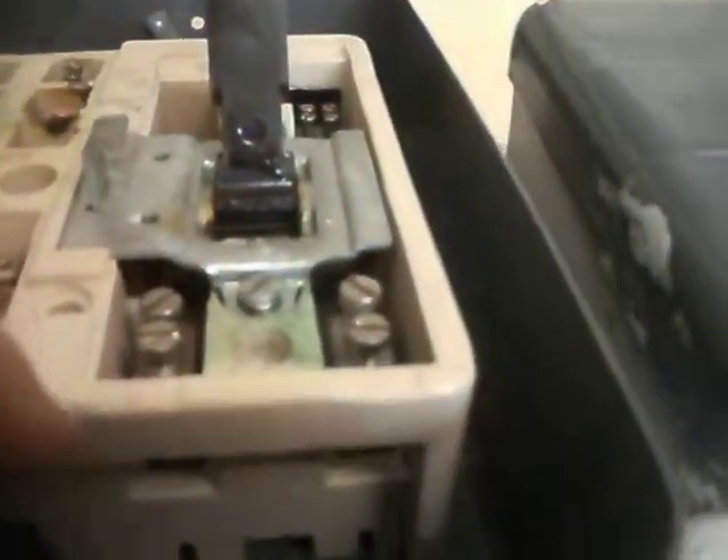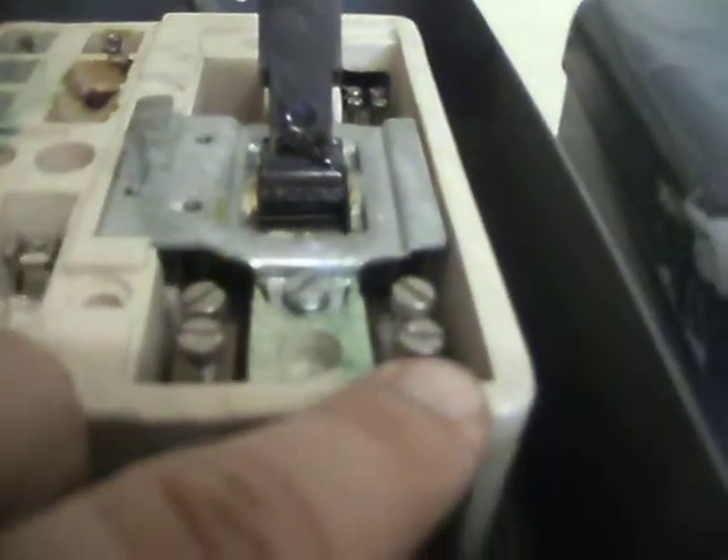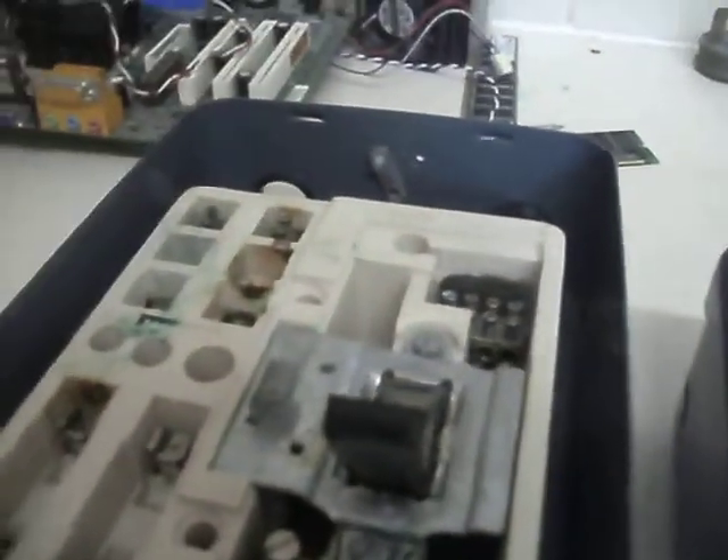We've got a big hole at the bottom for the cable coming in. We connect your live to this one, neutral to this one, and they have two screws to clamp the cable down nice and tight. There's your master switch, which, while the lid is off, you can't turn it on. To turn it on with the lid off, you have to push down on this little catch here, which will allow you to turn the unit on.